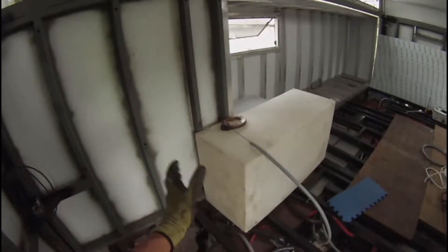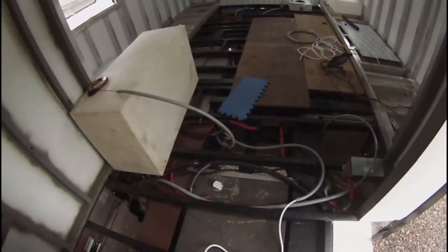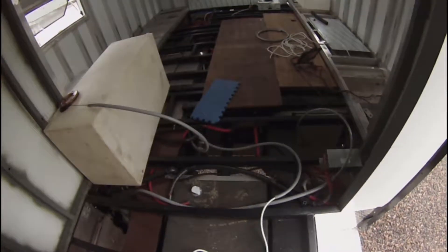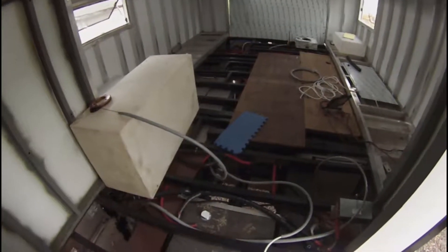I'm going from the control area underneath the frame to my Oasis - that's a straight shot. I've got my 30 amp coming in - the white one - and then I think that's 6/4 jumping across to my island, coming from my main breaker panel to feed a sub-panel. The reason is that sub-panel is going to be in part of the slide-out, so I had to figure out how to get power across that moving surface. I had to get a feed under the floor before I bury everything.